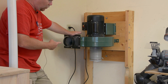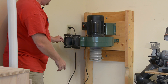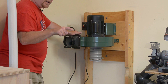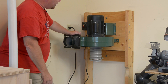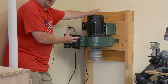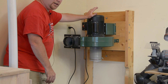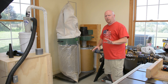Before I roll the barrel back in here, I want to show you what I did with the motor. The way this unit is designed, the motor is supposed to sit on the floor and discharge straight up. The hose that comes out of here goes up, makes a sweeping bend, and plugs into the side of the separator and filter bag. In order to make the barrel work, I need draft coming straight out of the middle of the top, so I had to turn the motor 90 degrees and build a framing structure out of 2x6s behind it to essentially hang the motor unit from the wall. It's not a complicated thing to do — I way over-built the whole thing as I always do — but this unit is heavy. It's a relatively good quality 2-horsepower motor and I really didn't want it to crash into the floor.